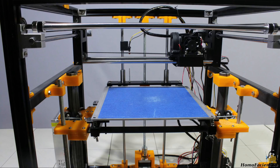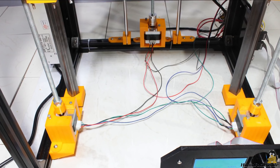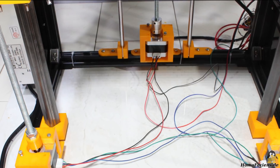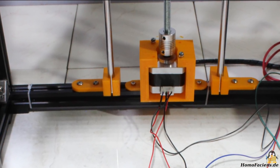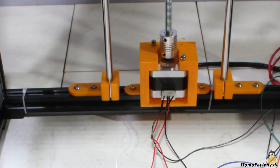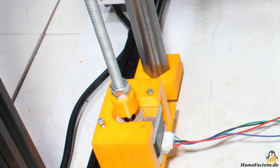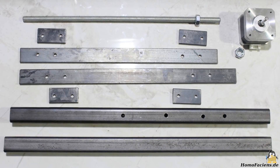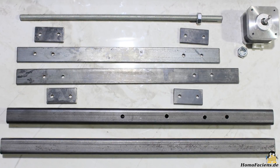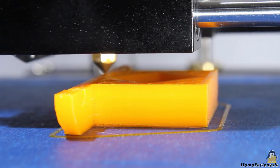Back to the drawing board to make things right. A tripod construction eliminates backlash in vertical movement; I am using three stepper motors for the Z-axis in this configuration. All three motors must have the same angular resolution, which is 3.6 degrees for the motors I had in stock. The original motor has 1.8 degrees per step, so I had to replace it as well. I am using common threaded bars with 8mm diameter as spindles. Additional guides are composed of 20mm square tubes, and the build plate is connected with the new bearings through 20mm flat iron bars.